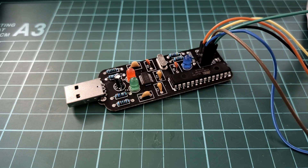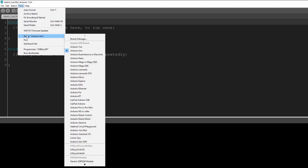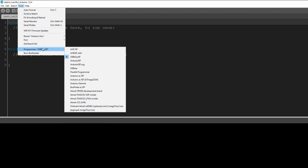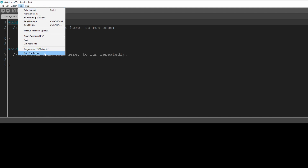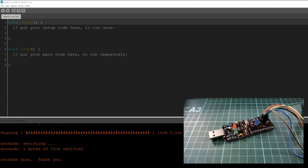This is hooked up. In the Arduino IDE I go to Tools and as the board I select the Arduino Uno. As the programmer I'm selecting the USB tiny ISP, and then all I have to do is burn bootloader. Hold on to your hats because this is going to go pretty quickly — and that's it, that was real time, and we have successfully burned a bootloader to the ATmega.